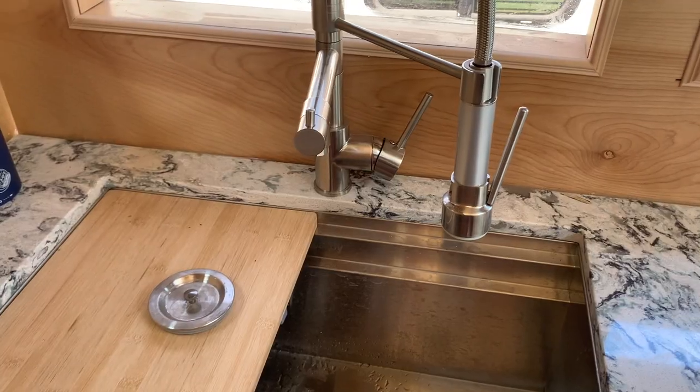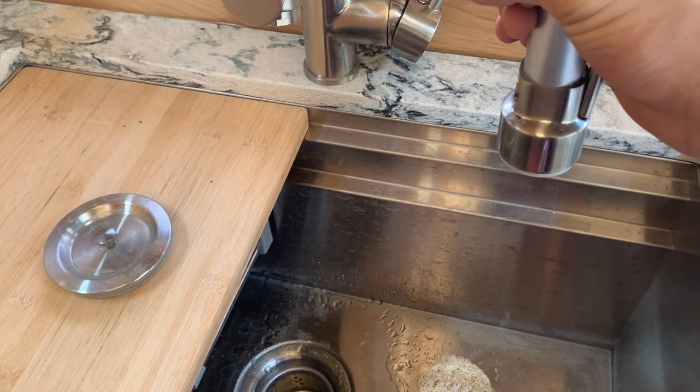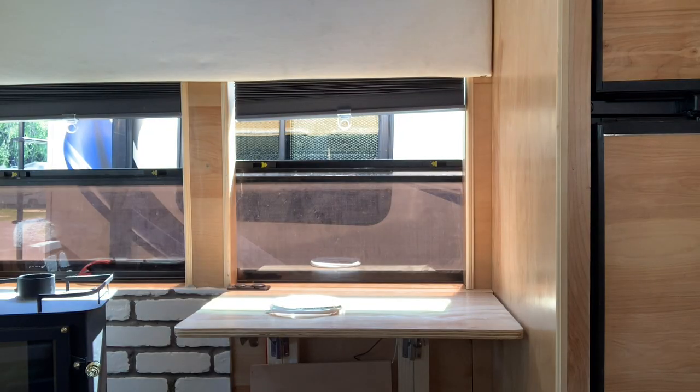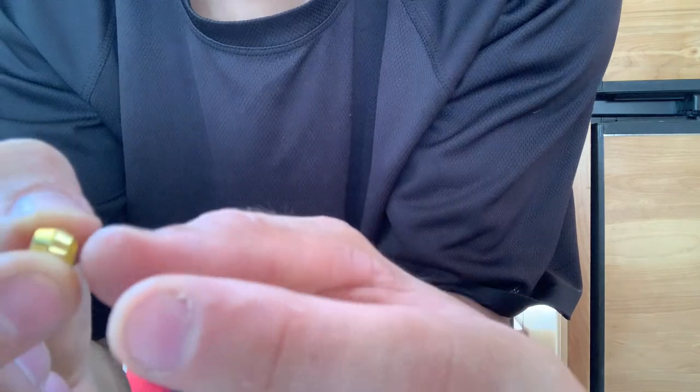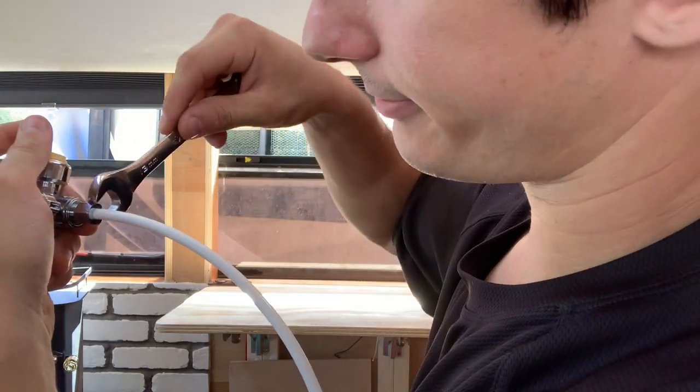One thing you want to make sure you do: take the power out of the water pump and then let all the water out of the lines. Let all the water out. I'm going to take this nut off — there's going to be a little nut and a little flange, whatever you call this. These two pieces: this nut with the threads facing up because it's going to thread into the T-piece. Then you put this little flange nut — that just goes like that. Push that in. And you screw this on like so. I'm going to cut our blue PEX pipe, which is running our water from our pump. Should be pretty simple, but let me put down a towel first.